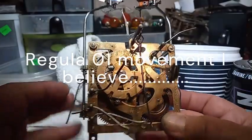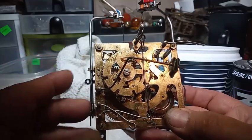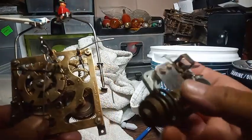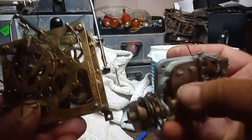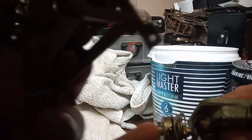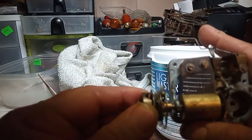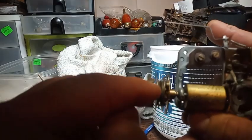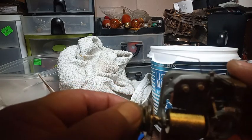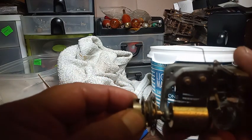When the cuckoo bird is tripped to go out, this lever right here trips the music box. This wire right here goes into these holes on the music drum, and this is what causes the little man to go out of the case — that wire goes into those holes and as it rotates he goes out of the case. Then there's another hole which allows him to come back inside.